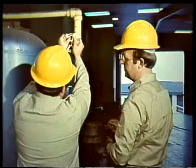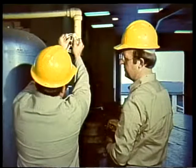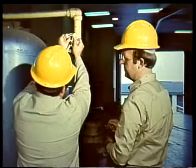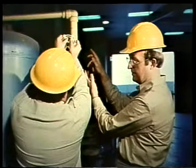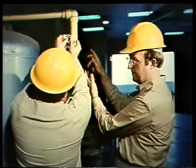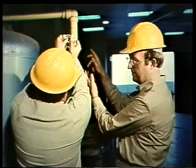Also, keep an eye out for other personnel who might be operating a valve improperly. Damage through improper operation can be a real headache. Show them the right way, but do this in a helpful manner, and they will be glad to know. No one wants to cause unnecessary damage to plant equipment. Well, valve inspection should be a part of your routine, and be sure to clean and lubricate valves when you see that they need it.